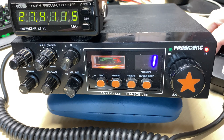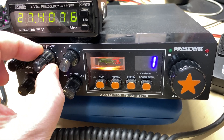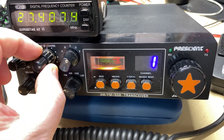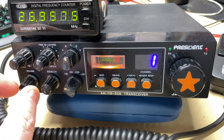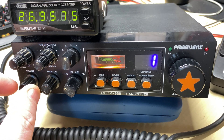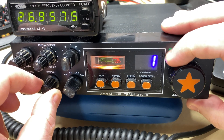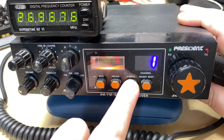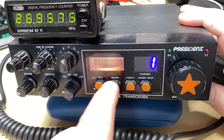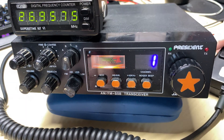The RX light isn't working but the TX light is working. When you TX, the frequency is changing on the counter, and the coarse clarifier doesn't seem to be doing a lot. The bands are working, but when you TX it's changing frequency and we have no RX LED — that's the smoking gun here. But it took me a while to find that, so let's go through.